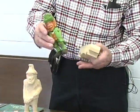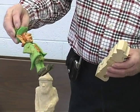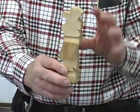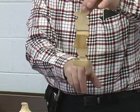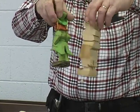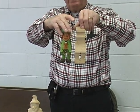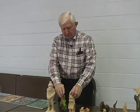This is a piece that is a finished piece, more or less — a little character that actually looks like a little leprechaun. Now, to do this particular piece, you start with a square piece of wood. If you have a pattern, you lay out the pattern and you band-saw it out, or saw it out with a coping saw, both front and back. Then if you turn it sideways or backwards or forwards, you see what your shape is going to have to be on the side. So you band-saw the side out, bring it down, get your proportions where your shoulders and head are supposed to be. And then you work with that, and you end up with this — cutting from a rough out.